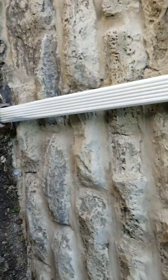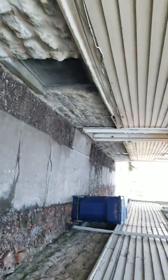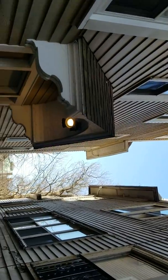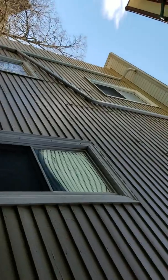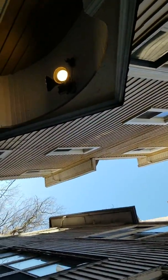The neighbor next door said the drain tile might need some snaking out, because that's what happens when you don't have a proper gutter system or have one that's clogging up. This could be a 2x3 leading into the lower still — the same issue — but these lower downspouts should be changed to a 3x4 commercial size spout to get more volume.